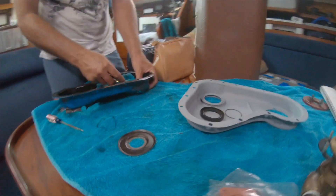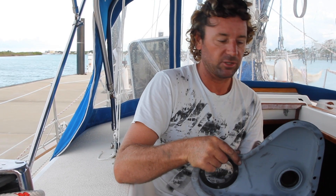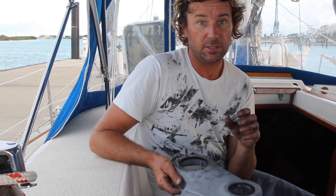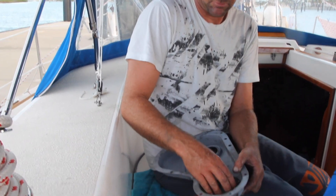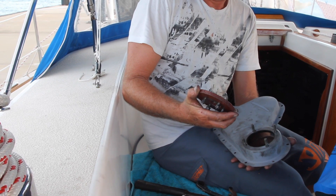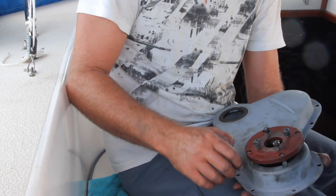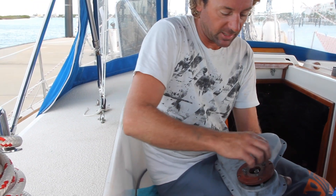We've got a new water pump and a new plate for this — which has been fabricated up. They don't make them anymore, but luckily we found a company that fabricated ones off normal engines and punched the hole in it for sea water use. The marinized version just got this hole stamped in, which we had to pay to get done. This here is the sea water adapter plate. It's very important that you have it centered perfectly before you tighten these bolts up — if you don't, it causes this to spin wrong, and that's the whole cause of our problems.